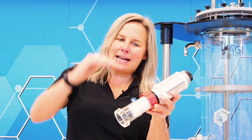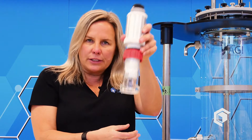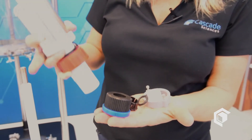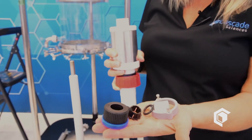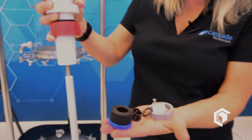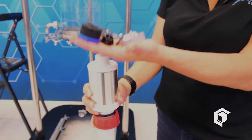Smack in the middle on the top of the reactor you'll find what I call the stir bearing, or agitator mechanism. This sits right in the top center and allows the stirring blades to rotate. To insert the stir rod into the stir bearing, you need to do a little disassembly — just unscrew the hex screw nuts, take apart the top of the bearing, slide it over the stir shaft, then reassemble.